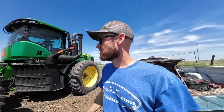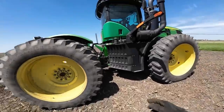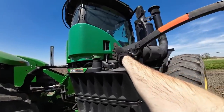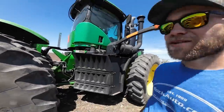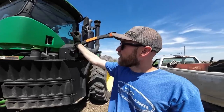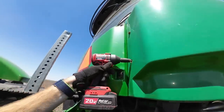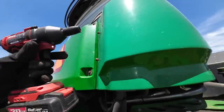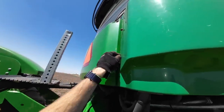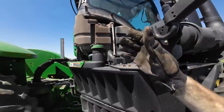I have to get the oil into the machine — I'm going to go on a little bit of a rant. I'm a big fan of John Deere tractors, they make a great tractor, but this is the single stupidest design flaw that they ever did on these tractors. You have to take this body panel off to put hydraulic oil in it. Do you know how many times we've blown a hose and lost hydraulic oil? It's like a two or three times a year occurrence, so we're always having to put hydraulic oil in stuff. Why couldn't you just put the fill outside of the body panel? Just dumb. I've got to take all these little bolts out just to put hydraulic oil in. Doesn't that seem silly? Body panel's off — why couldn't they have just extended this spout and put it right out here on the outside? That would be way more convenient.